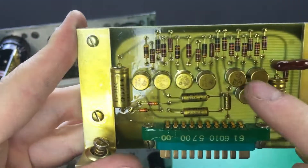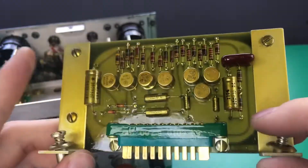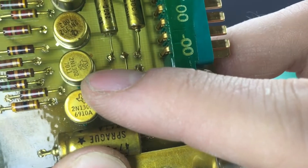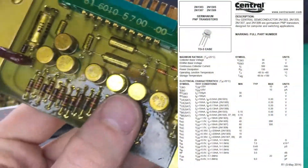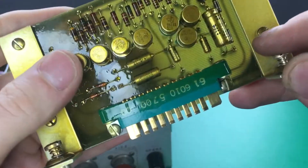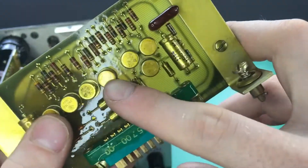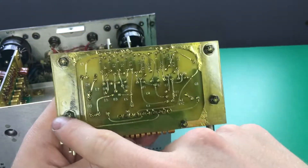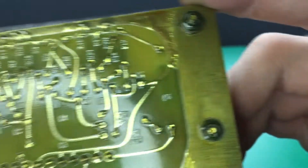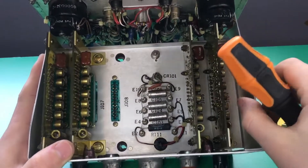Very old style PCB. We have some resistors up here, these capacitors, and also this capacitor. We have lots of transistors. These transistors have a date code of 1969 and 1970. I was able to find the datasheet for these — they are actually germanium PNP transistors. Germanium transistors became obsolete decades ago before they switched to a more reliable construction method which used silicon. We have this large ground plane all around the circuit board, and some of the resistors are connected to it. So you can see this is a very old style of hand-traced PCB.